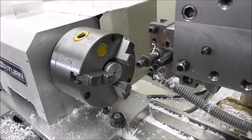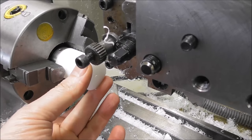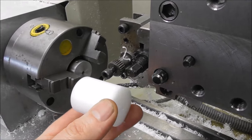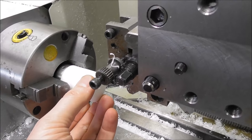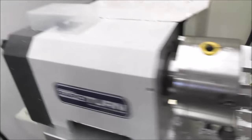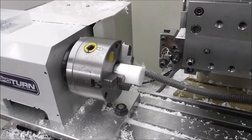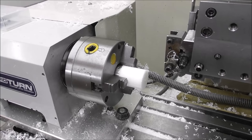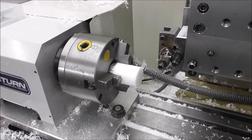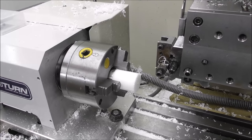It's a great plan to have a stop in your CNC rapid turn chuck so you can pop parts in up against the stop - they're all the same length from the stop used in the manual lathe. You can then pop them in your rapid turn and back-to-back machine them in pairs. Here we have the same system of sliding stop mounted through the spindle bore of the rapid turn, allowing you to machine larger diameter parts than you could fit through the spindle.